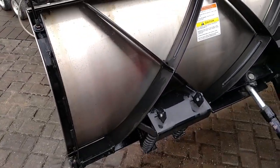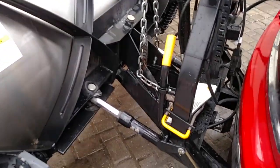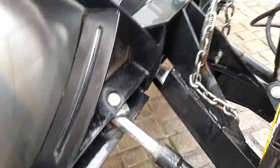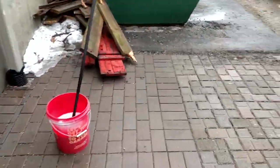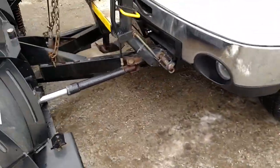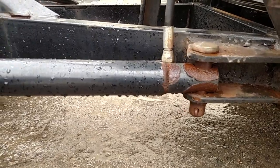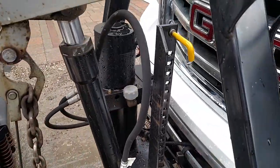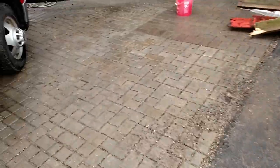As far as the power washing goes, I'll show you two exact same plows, same years. This one we have had since it was brand new — look at the springs, everything's in great shape because of how we've kept it. Now I'll show you my plow truck, which we've only owned for a couple years but it's the same year. Look at the springs — they're all rusted up. Your cylinders are all rusted, even the plow frame, your jack, your chains. Everything is just not in as good a shape, and that's because it wasn't cleaned like we clean ours. It's really worth it.